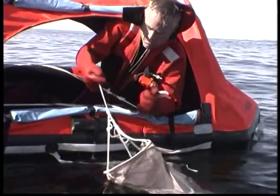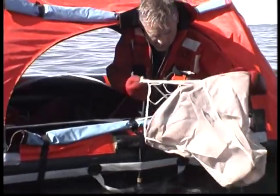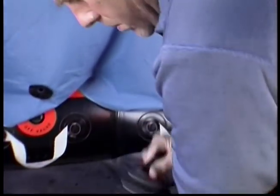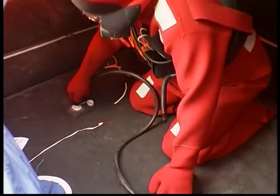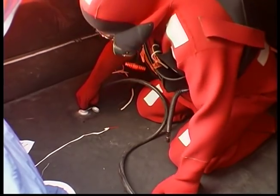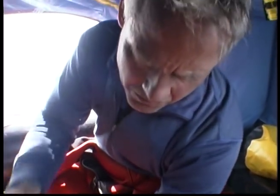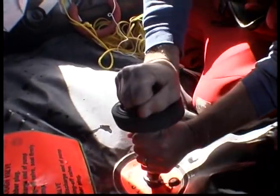Adjust the length of line so that when you are on top of the wave, the drogue digs into the trough. There is a spare drogue in SOLAS A and B packs. If seas permit and you wish to travel further in the direction of wind and current, remove the drogue from the water; redeploy it if you want to decrease your progress. The pump is used to keep the Life Raft fully inflated. Inflatable floors do not inflate automatically — find where to inflate the floor and inflate it. Even in tropical waters, you will want the floor inflated for insulation. Some floors do not inflate but have built-in insulation.